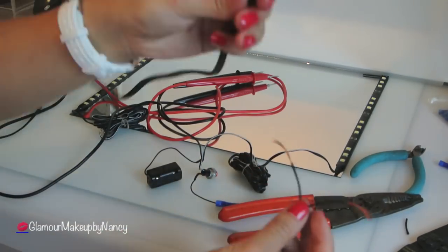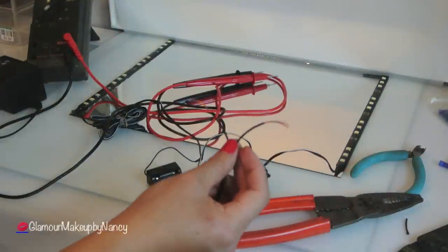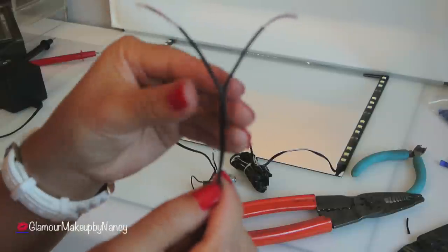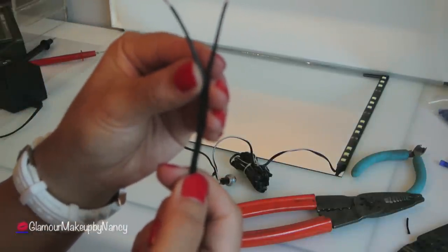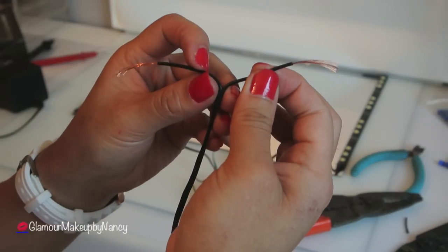To test which wire is positive and negative on the 12-volt DC adapter, plug in the cord on the other end of the cord to the wall outlet and then use a multimeter again. Try not to have both wires touch each other, which may start a fire. Ask for help at this point if needed. Once you figure out the wire, unplug the adapter off the wall outlet.